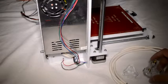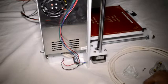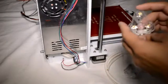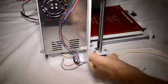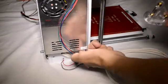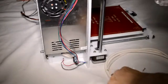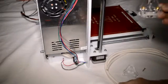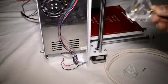The last step is to connect the plug to the remaining cable and connect the cable to the power supply — this is for the 220-volt supply from the wall socket. If you open the plug, you'll see it's usually marked: the pin on the left-hand side is for neutral, so it goes to the N on the power supply, and the pin on the right-hand side is marked L for live and goes to the L on the power supply. Use the blue cable in the cord to connect to neutral, the brown one to connect to live, and the yellow and green cable to connect to earth.